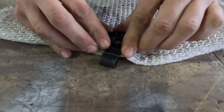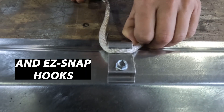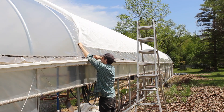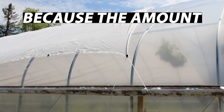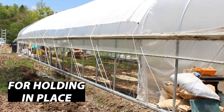After we have the grommet clamps set up along each side, we're going to run rope through the grommet clamps and the easy snap hooks we've installed on the baseboard, until we get to the last one where we'll end the rope and tie a knot. The shade cloth on this structure doesn't really overlap both of the end walls, and that's okay because the amount of securement we have on each side of the structure is sufficient for holding it in place.